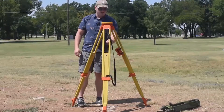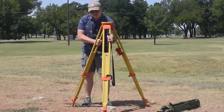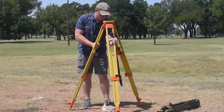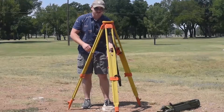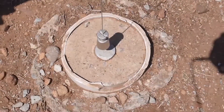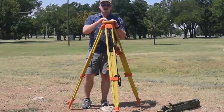Right now I'm trying to get my rough plumb and my rough level — that's going to be the first part of this. I can see that I'm not over the point that I need the plumb on, so I reach through and lift it straight up and move it around, making small fine adjustments, trying to move all legs the same direction and the same distance. This little orange tab here I can slide up and down to make the plumb bob hang lower or higher. Notice I didn't take the tripod cover off because it's actually holding the plumb bob center while I'm getting my rough plumb and rough level.